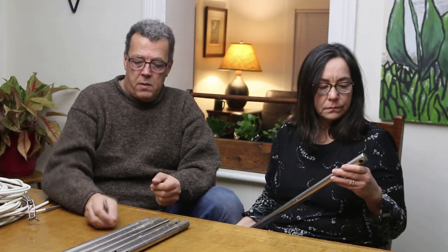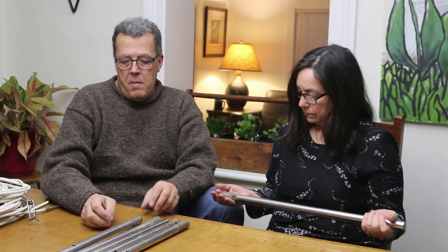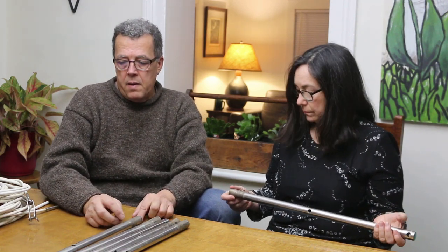That's part of the reason I argued for 24-inch ones, but the main reason is that I think lifelines can make you a little overconfident, you know? So when you're going forward, the purpose of the lifelines is to stop you, as a last resort, from going over in a sea. But if you're in a seaway, you should be keeping one hand for yourself and one for the boat. You should have a tether if the weather is really, really bad, and the lifelines should not be depended on to keep you in.